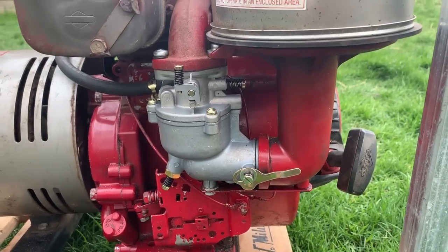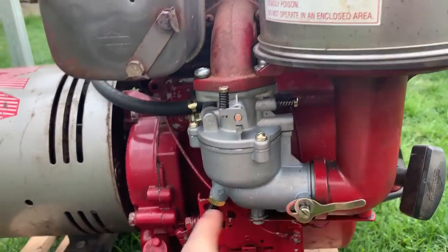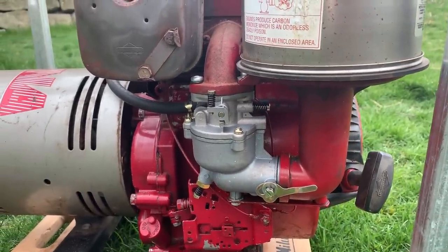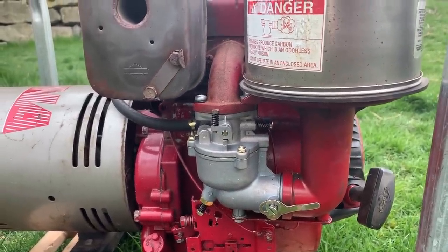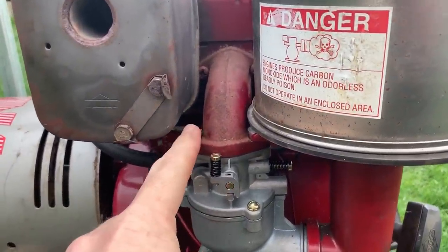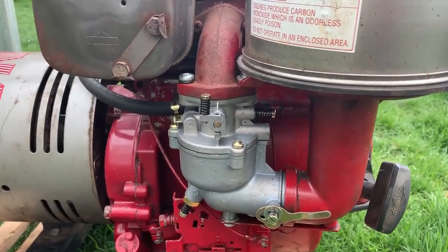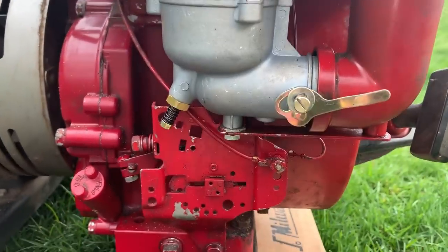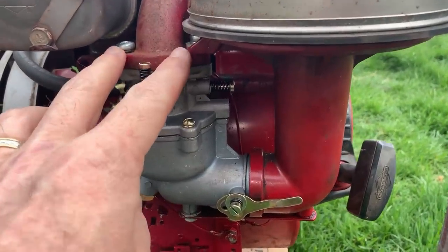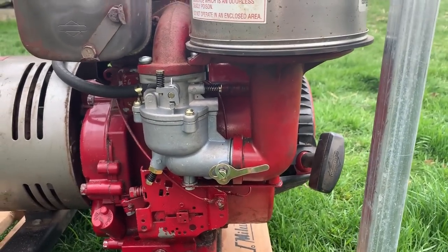All right, so the new carburetor has been installed and I got the pilot jet at 1.5 and the main jet at 2 turns out. Now there were some fitment issues which were expected from the reviews, namely that the bolts up here are no longer quarter inch, they're M6. So that's been installed. Also it seemed a little bit taller. It was kind of hard to squeeze it in between, you know, the intake here and this bracket down here, but I managed to get it to fit.